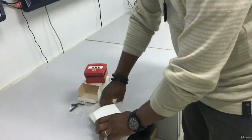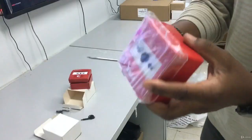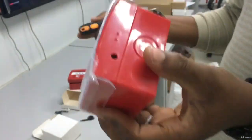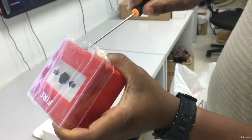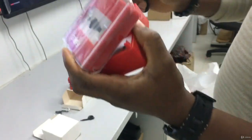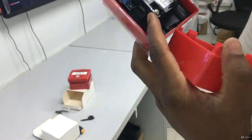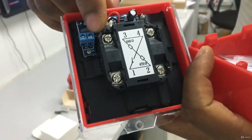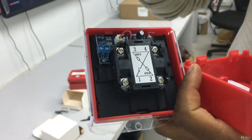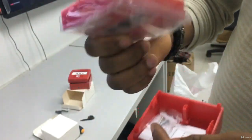I am going to move on to the next one, which is another type of call point. You open this with a screwdriver. There are so many different types of call points and the way you open them is different, but this one you just open gently with a screwdriver because it has a lock inside. So you see inside — you see all these terminals here and there, but these are the only terminals you have to use: this is the positive terminal and then the negative terminal. Those are the only two things you need to use. And then this is the screw mount, to mount it on the wall.